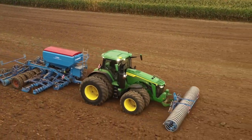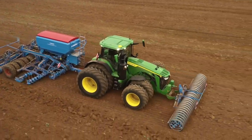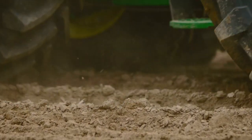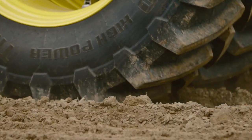During cultivation and inspections, tracks are left in the field. Depending on the soil moisture, the weight of the load, and the size of the ground contact surface, these tracks have different depths. The deeper the tracks, the more diesel is required, and soil compaction also forms. These compactions cost money to create, during harvest and during later loosening.